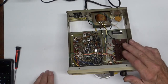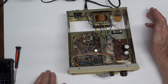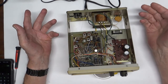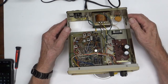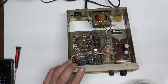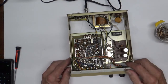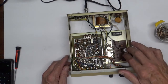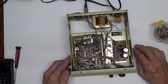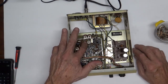I did not mess with the power supply anymore, and yes, it's just as dirty as it was. Evidently, this wave shaping thing makes it work, but it's awful. I hate to see something like that. So basically, all I did was replace the capacitors and that Zener diode and these caps in here and the other diodes in there. Checked it all out. Replaced this 1496, MC1496.